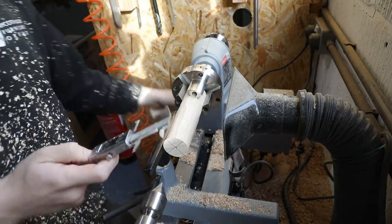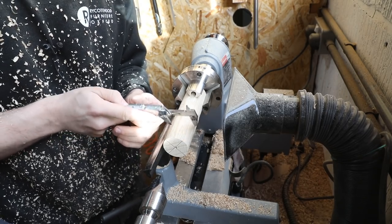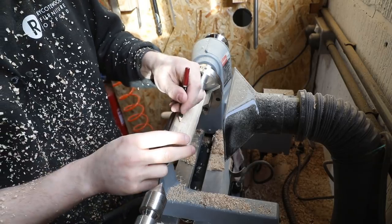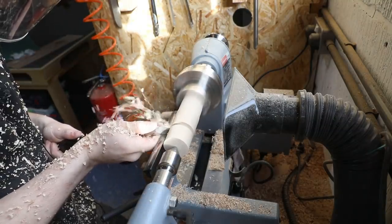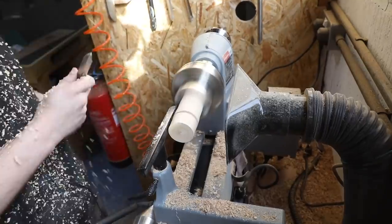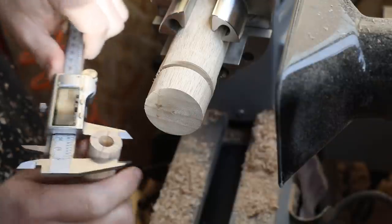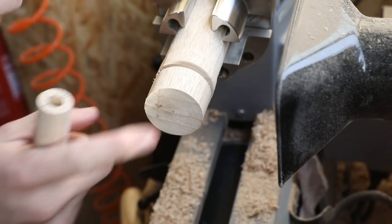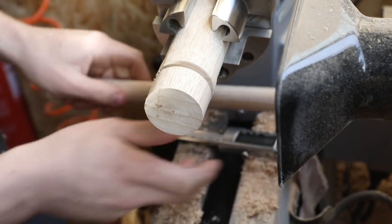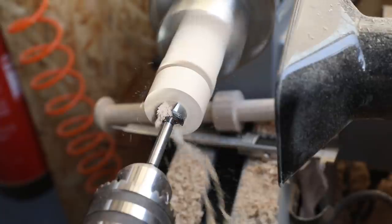Upon testing the fit on one of my current divider sections, this section got a bit too small, but I've got a nice section here that is the exact diameter I want. So if I part it off there, get rid of this bit, then I'll start boring out that bit to become my sleeve. In theory if I do that and tighten it down, then I can measure the bore using these ends of the calipers and that should be a nice tight fit around here, hopefully.